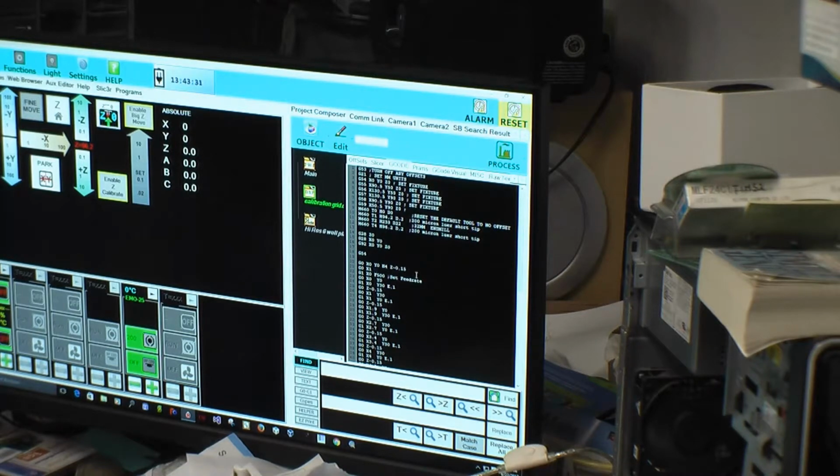Got the minus correct, and in this case we're going to go to a plus number, so let's go to minus 5. Z minus 5, so that's minus 5 millimeters. Alright, and I move it to set the feed rate back, and we're already at G0, X0, that is really redundant. All these G0, Z moves can go away.